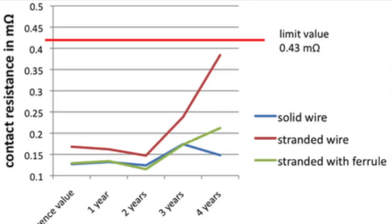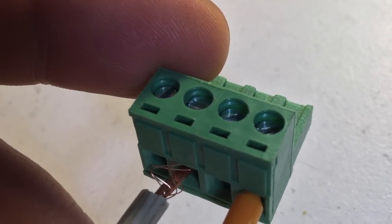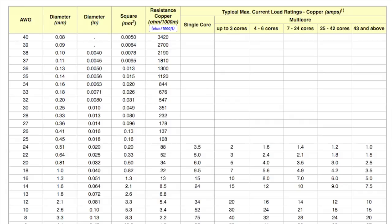If you're using wire without a ferrule, you have a couple of basic problems. First, you're flattening out the stranded wire and not all of the wires on the edges are going to be making contact, so you're not taking advantage of the entire diameter of your wire — basically making it a slightly smaller tube. Second problem is oxidation. Copper does oxidize pretty readily, and since you can't tin it because of the creep, you're going to get oxidation in there. That's been measured over a two- to three-year period as increasing contact resistance by three to five times. If you've had this printer for a while, fraying plus oxidation could mean much higher resistivity than before, and eventually it's going to melt your terminal blocks. Use wire that's rated for the current you're going to be passing through it.